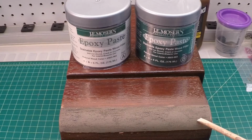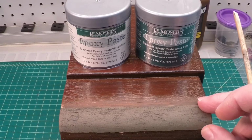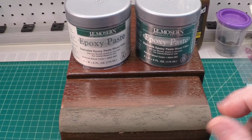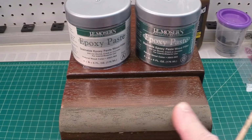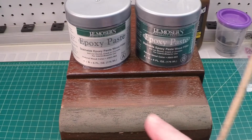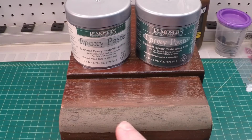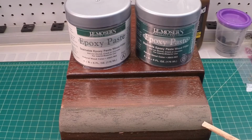One thing that I like, I was able to take the 60 grit paper and put pressure from here to here and create a fairly nice corner piece after forming it by hand. It also created some texture in the epoxy, which makes it look more wood-like. And you guys probably caught I used a razor and went back in here and created some grain lines. I've tried to get a light positioned here where they show up on camera, so hopefully you're able to see them.